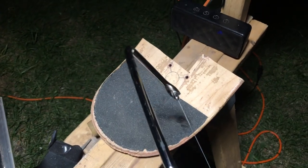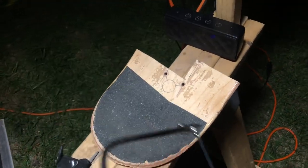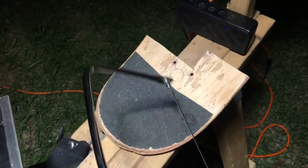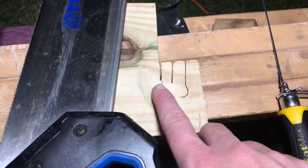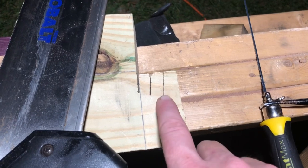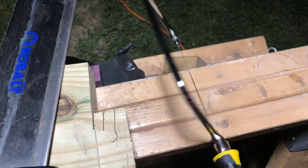This is a Stanley coping saw with a blade that's 20 TPI — very fine. You'd use this kind of saw for the same things you'd use a scroll saw for. The blade comes off by unscrewing the handle, and you can slip the blade through a hole and cut along lines to cut out a shape, then come back out. You could do something like that — cut out puzzle pieces or whatever.